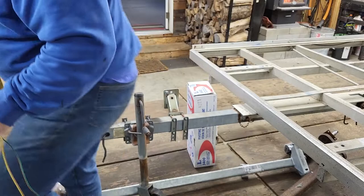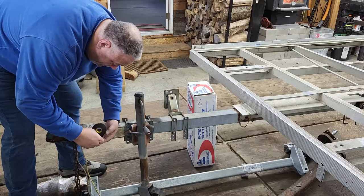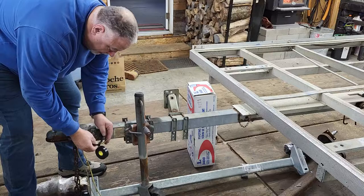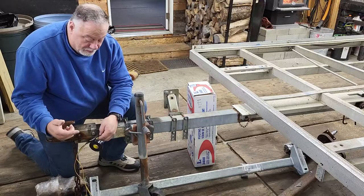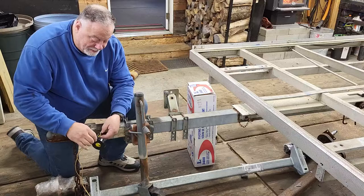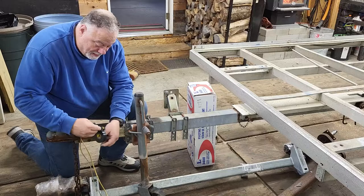I'm going to take these wires together, making one end longer than the other for pulling through. I've already cut the pigtail off, so I'll take this right on the wire that's hanging. At the end I'm going to bend it over - the reason is if I'm pulling the wire through and hit a tight spot and yank on it, it could slide out of the tape. By bending it over and taping it on itself, it prevents it from being ripped out. Let's go.